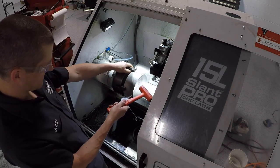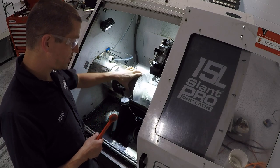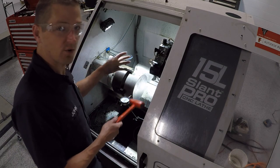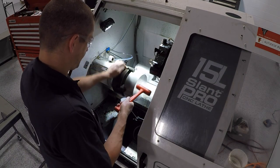I want to make sure I'm seated squarely. Now the piece yesterday is a saw cut, so not all four pieces sat perfectly. We're machining all the geometry, so it's not hypercritical, but for rigidity and just general avoiding future problems, I like to seat them all.